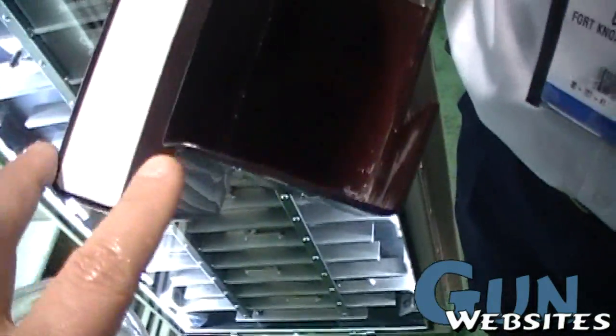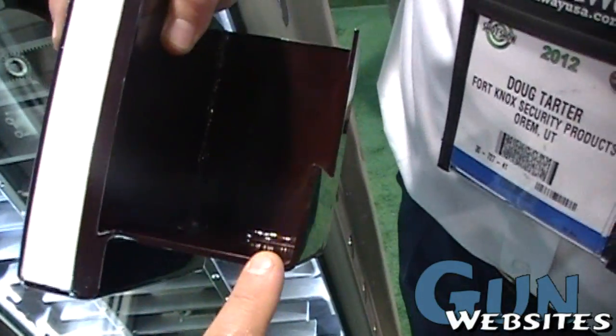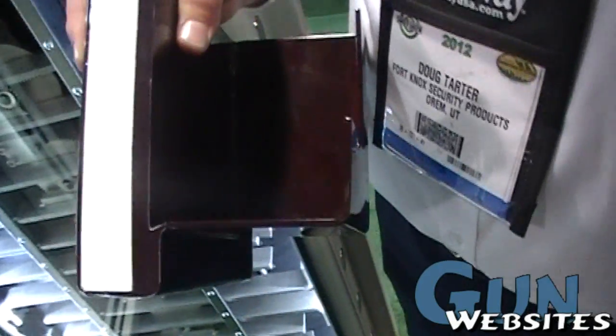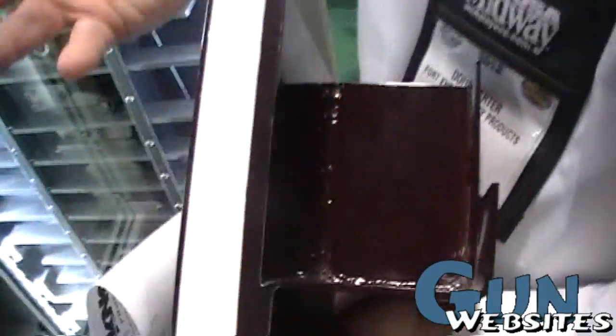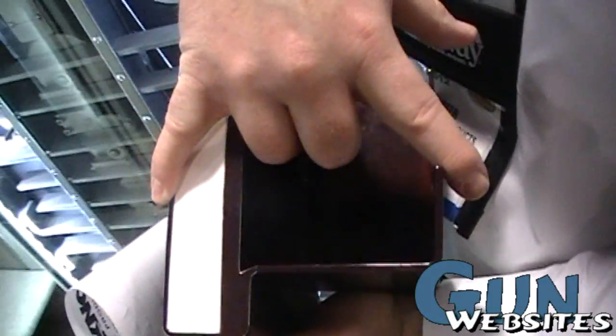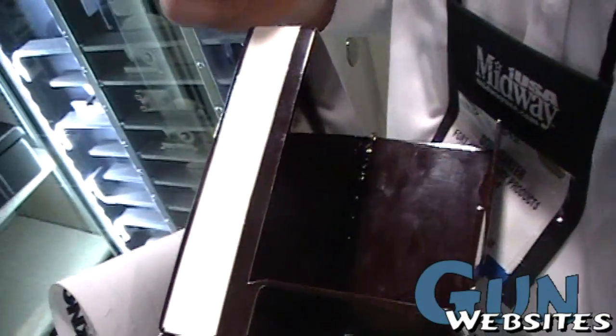And what you show here is kind of nice too, because a lot of times people just show this outside. This whole area here is where all these gears and mechanisms are, which adds nothing to the security of the safe. Correct. Of course, you guys put a 10 gauge piece of steel here, where other people will put a little bit less steel as well. A lot of those other manufacturers will call this a 5-inch composite door. Exactly, making you think that there's 5 inches of steel or something. Correct, and it's just from the outside to the inside of the mechanism cavity. It's basically hollow. Right.